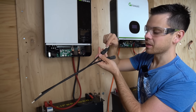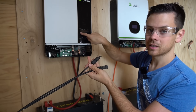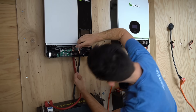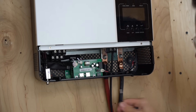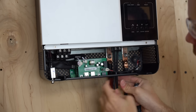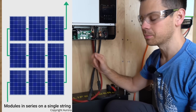Looking at the solar panels, this is the positive and this is the negative, so you want to reverse that when connecting to the inverter charger. Shove these in and tighten them down — first the negative, then the positive. After tightening, test them by pulling on them to ensure a good connection. For simplicity with small systems, I recommend a single series string.